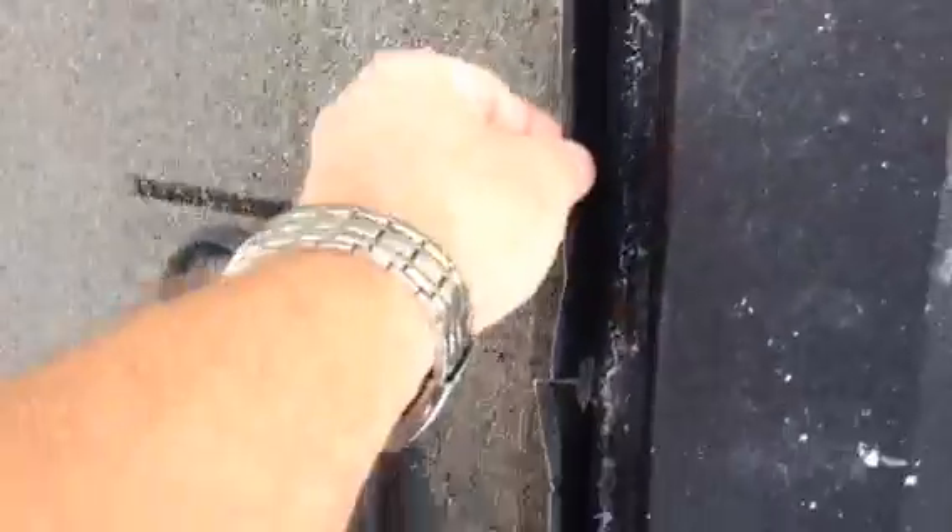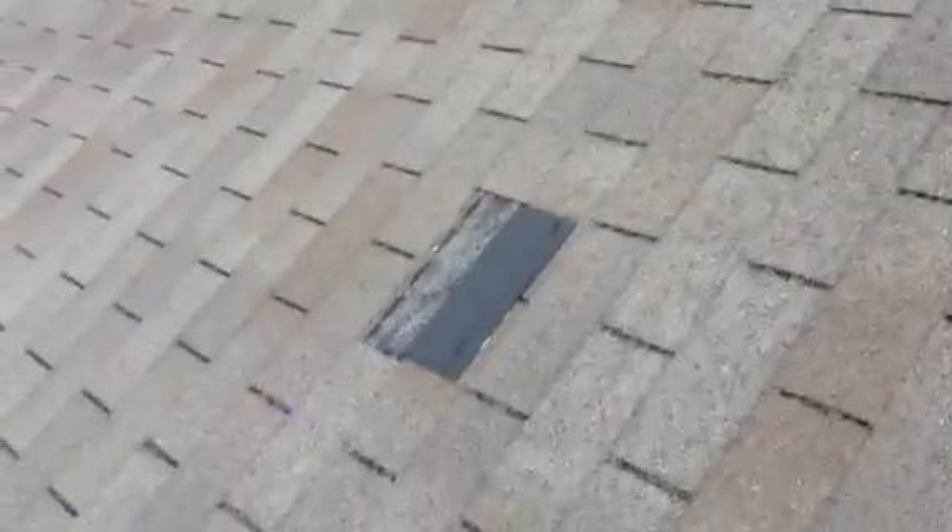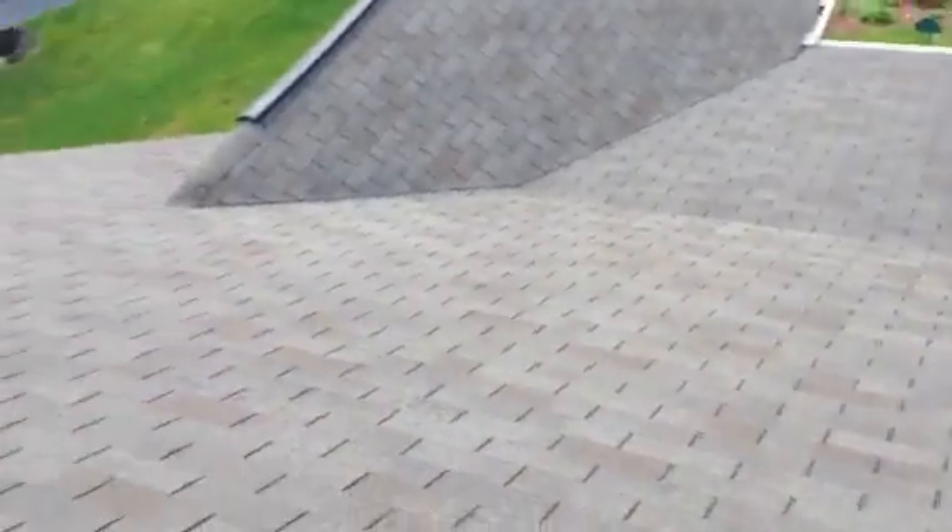This house has aluminum ridge vent along the peak, and the aluminum ridge vent is tight — but here's a spot right here in between nails that is a little loose, so I'd recommend re-nailing and tightening the aluminum ridge vent. We do have two shingles that have blown off here, which is common for a roof that is a few years older and was installed builder's grade.